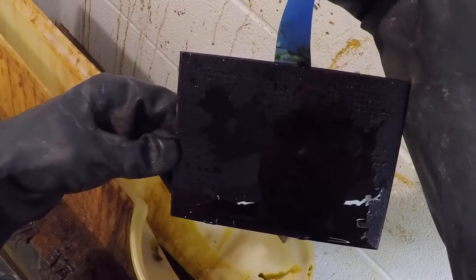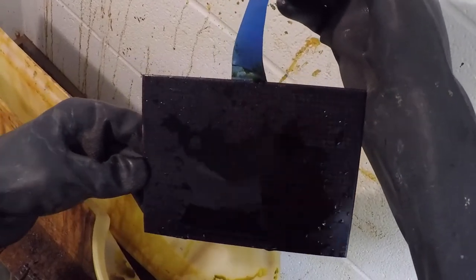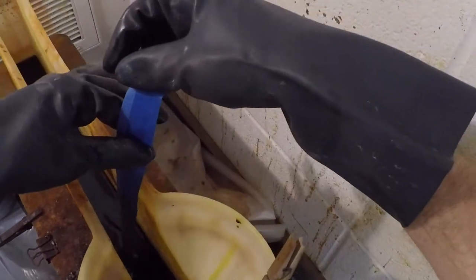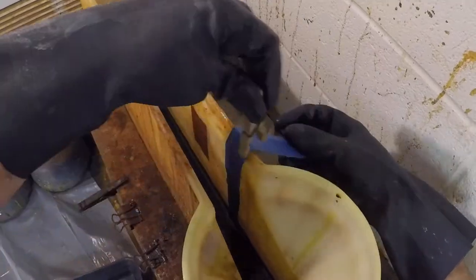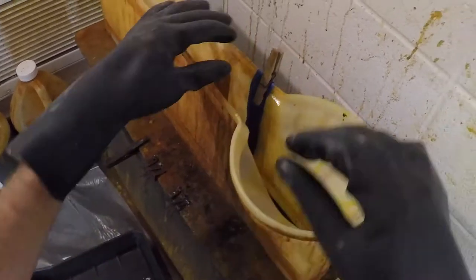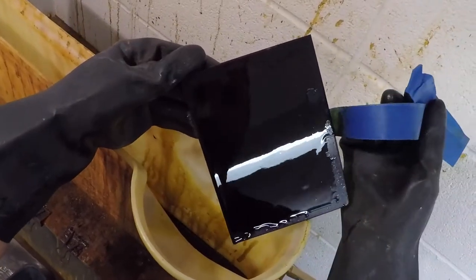After 25 minutes, the ground is still intact, the lines deeper, and the ferric drains even more slowly. Make sure the drips fall back into the tank. This is the end of 35 cumulative minutes: 5, 10, 10, and 10. Looks like the ground is still holding up.